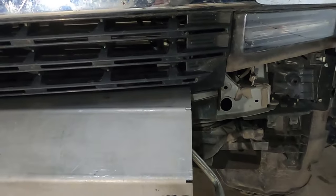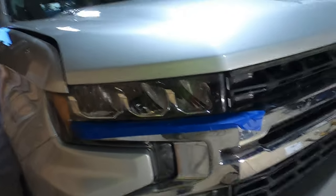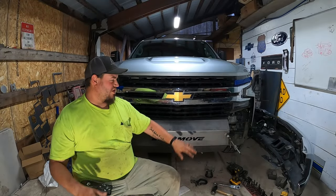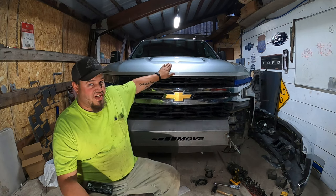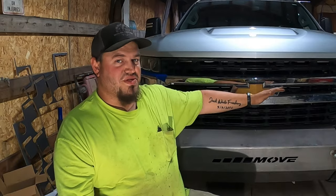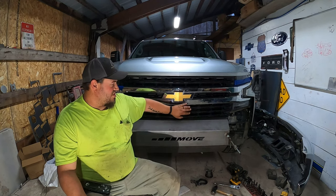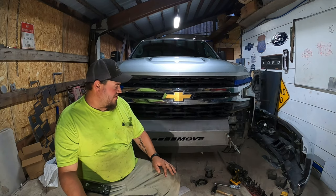Check other areas too — looking at this little notch, that notch is pretty much in the same spot. You also really need to make sure that the height is okay. Now it's time for my favorite part: we're going to bring out the welder and tack this section. I've already disconnected the battery, which is one of the most important things. I'll grab some sheets of aluminum to use as shields because we don't want sparks to hit any of the factory paint, grill, or anything like that.